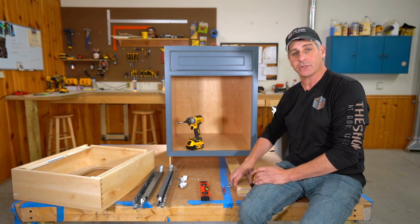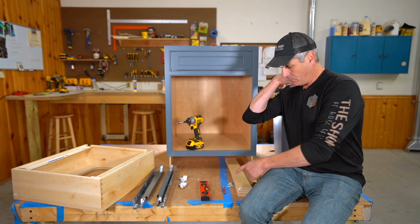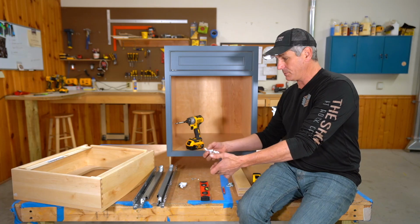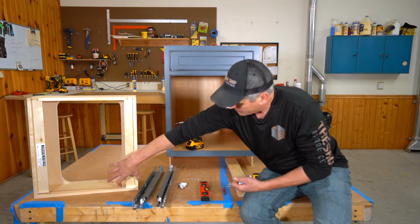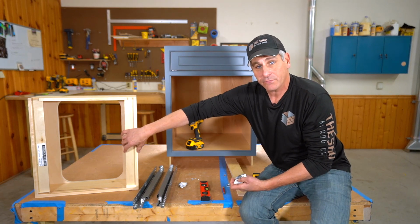So if you're someone who's watching this and you only ordered the trash pull-out, that's going to come with it as well. You're going to get these two funny looking clips. We're also used to seeing the Blum Tandem orange clips, the release handles. The problem is on this particular, I'll call it drawer box, they don't fit here. The orange handle would stick way out and then be into our area where the trash cans can fall into.